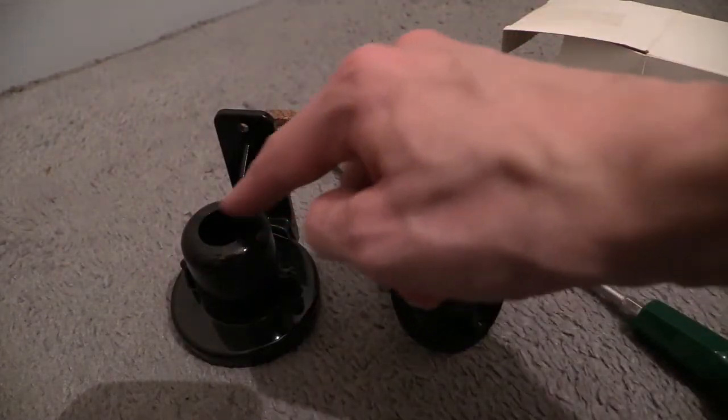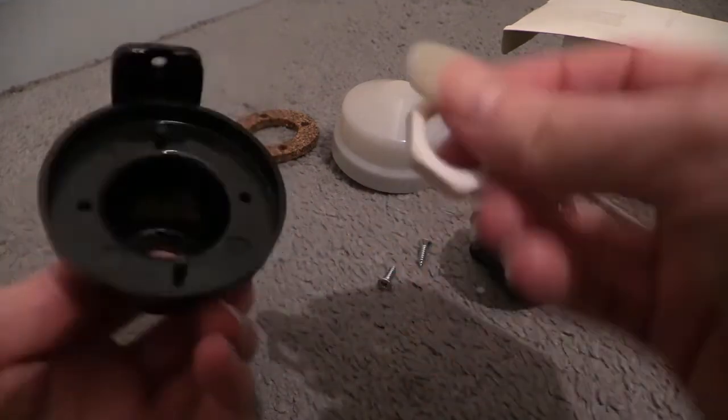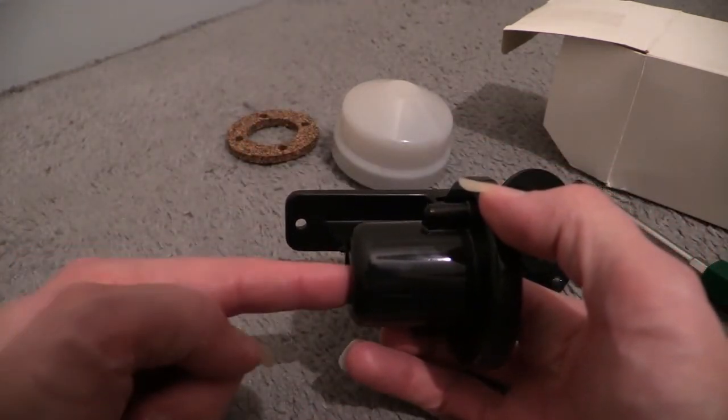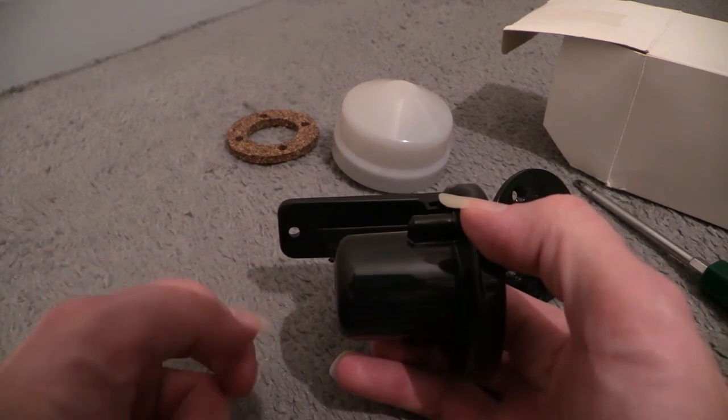When they supply these, they don't supply some kind of sealing gland in there for where the cable goes in. That's mainly due to the fact that you can offer up a range of different cable management options to that. One of them is a 20mm conduit adapter. It will have basically a nut on the inside. If I can just get a nut, it'll look a bit like that. You put that down the inside, like so. There we are. And then on the outside, you would have a threaded section which would go up in there. And into that adapter, you then put in 20mm PVC conduit.